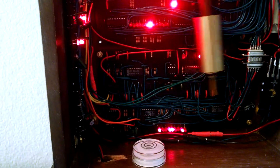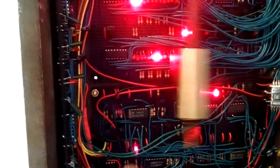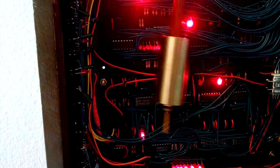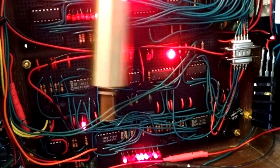Now for the part that counts how many times the pendulum swings. The sensor up here gets its light blocked on every swing. This little LED flashes in sync with the pendulum as the swing count. Every time it flashes, these LEDs update — they're counting in a binary pattern. The output of a binary counter: these LEDs represent 1, 2, 4, 8, 16, and so on up to 256 — powers of two.